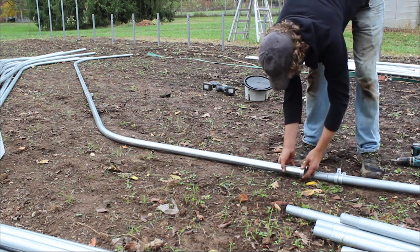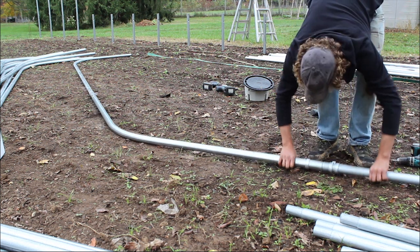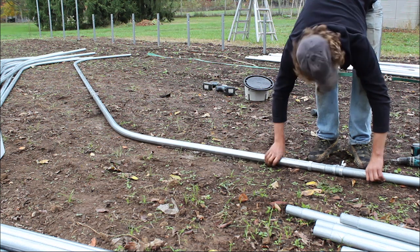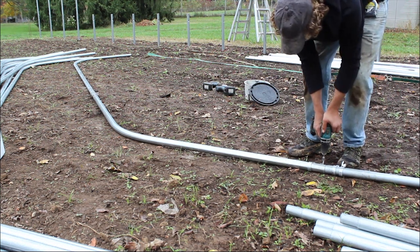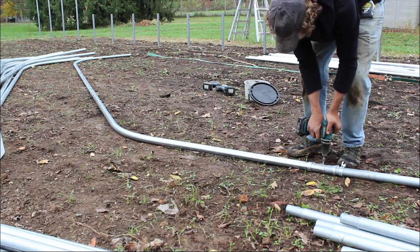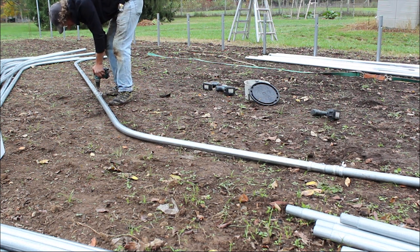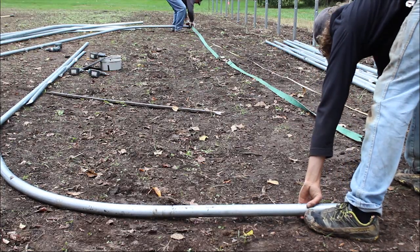We'll put on all the brace bands, and then we'll slide the other swage into the centerpiece, and we're now ready to connect the hoop pieces. So before we put the trusses and truss supports on, we're going to drive the screws that we previously showed how to drive in the last step. So with this hoop, it's no different as far as the order of operations go. After your brace bands are on and you've connected the hoop sections, you're now ready to get the hoop itself